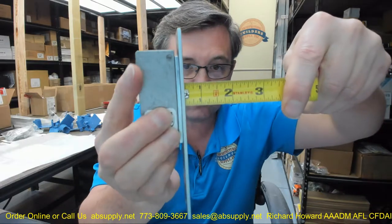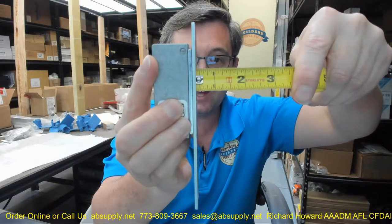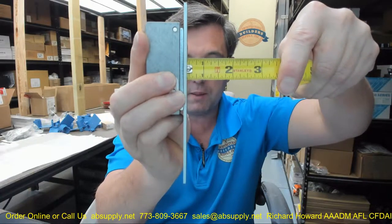Wood frame application. This is going to require that the latch bolt of your lock be no more than half an inch. It will not work with any latch bolt longer than half an inch. You can see that you are stopping short of half an inch because you'll have a small margin between the edge of the door and the frame — that's an eighth of an inch — so the depth of the keeper is three eighths of an inch. If you try to put more latch bolt into the keeper it will simply bind and the strike keeper will not reliably release. You've got to have that eighth of an inch margin and you can't have the latch bolt burying into the bottom of the keeper.